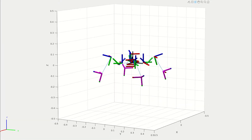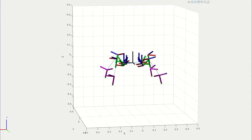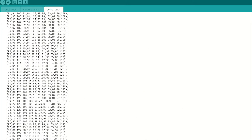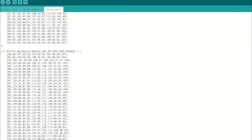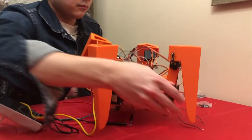Once satisfied with the simulation, the script uses inverse kinematics to solve for the angles at each servo at several points in time. I can then export these calculated angles to a file which I can program into the robot, and that way it should know exactly how to actuate its motors in order to walk.